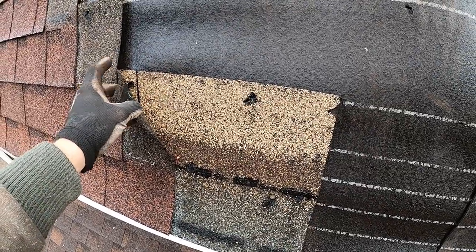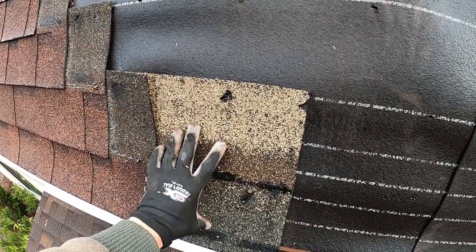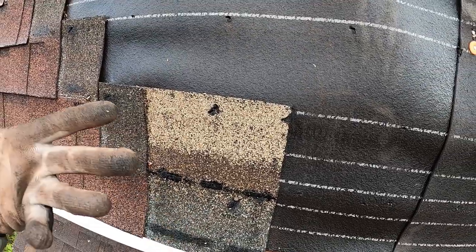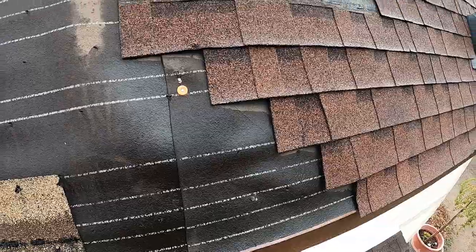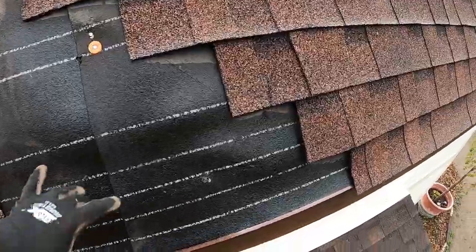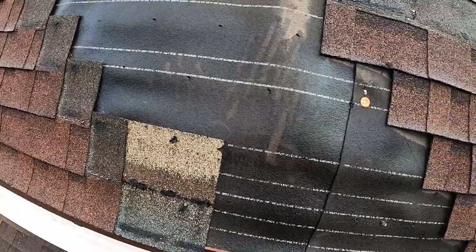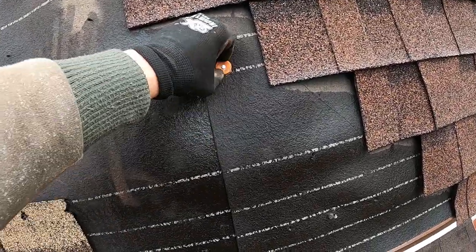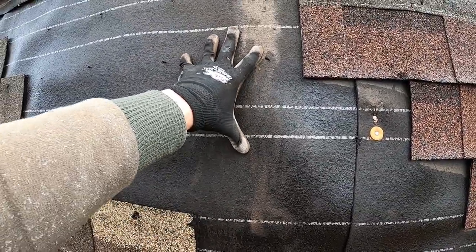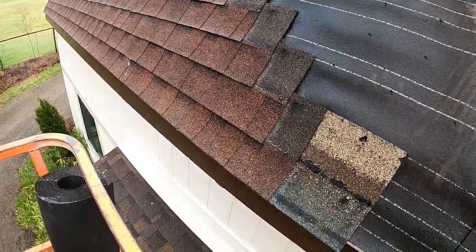And I don't know if I elaborated enough. For the bottom, you have one shingle row upside down and the other one normal side up, so double, and that adds a little bit of weight to the edges and prevents them from lifting up. So we are going to go ahead and get started by securing this roof felt with some of those metal cap nails. The previous installer used plastic cap nails. You can use those too. We're gonna take care of this bubble because this likely contributed to these roof shingles sloughing off and falling.